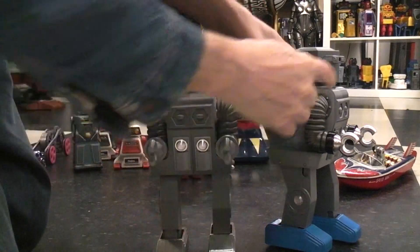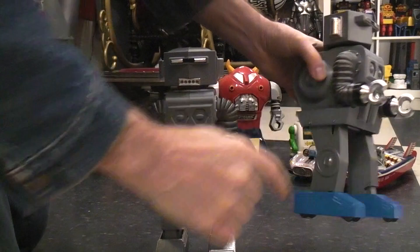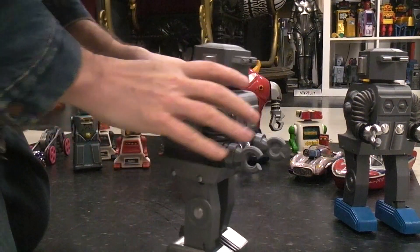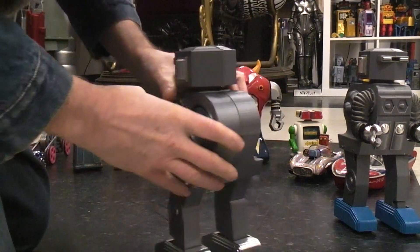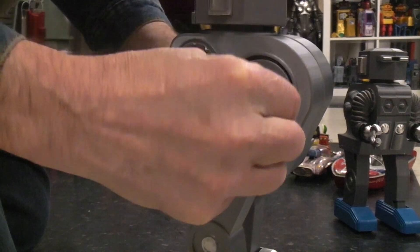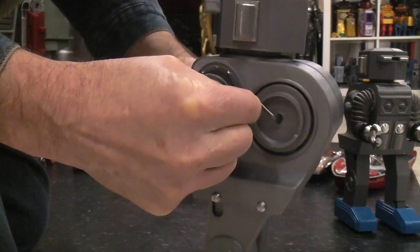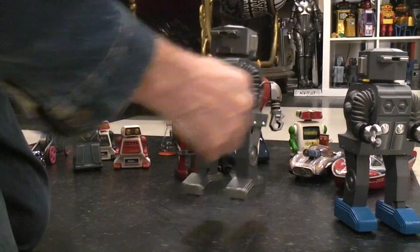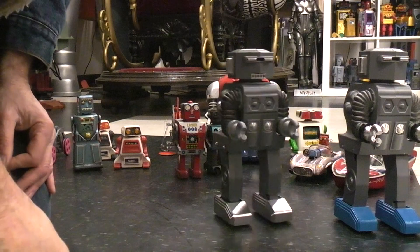This was the prototype — it didn't have a mouth yet or capture nuts for the bits. So I added a few of those things to this design. Here's the crank mechanism: it's on a slope so it'll catch turning one way, but if you hold the crank the other way it can slip, which makes it easier. You don't have to wind them up very much to get the flywheel going.